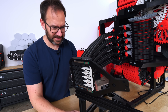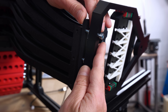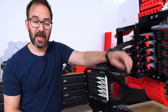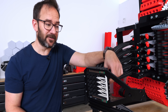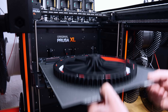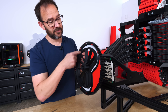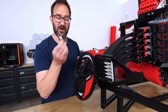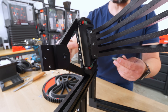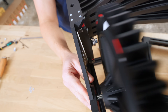It works, but it could be smoother. It feels a little bit too tight, so I will add some washers in here to act as spacers so it's smoother. And now that the display can move back and forth we need to transform the rotational movement of the motor into this linear movement, for which I printed this wheel in here. This wheel has a groove in it that matches the dimensions of this bearing, so the bearing can slide inside the groove. And there is a mount on the display slider just for the bearing. I can now get the wheel in here.